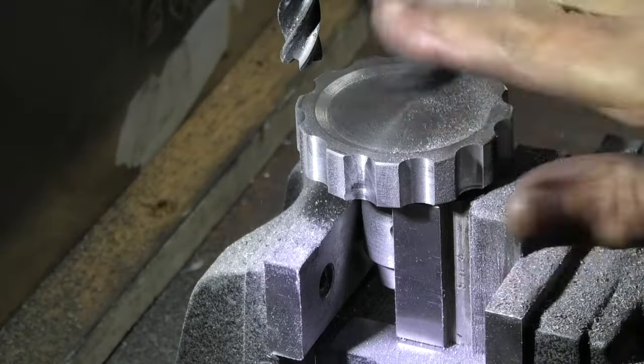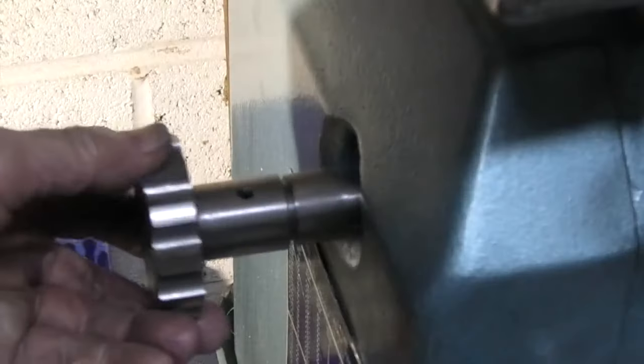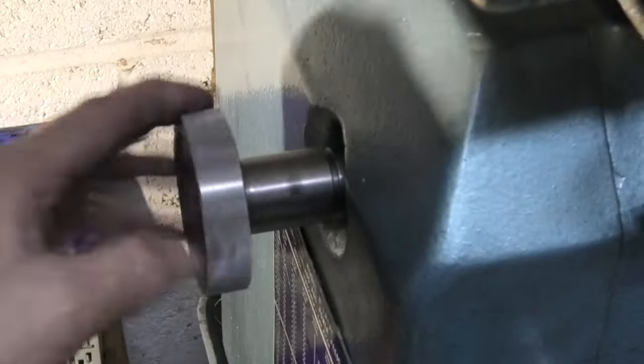Let's clean the face up, now I'll carry on working on the diameter. I'll just put a recess there just to make it look nice. The next job is to put the semi-circles around the handle. We select this symbol here which is pitch circle with holes round. That's the handle finished, and that screws into the back of the collet.